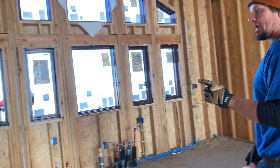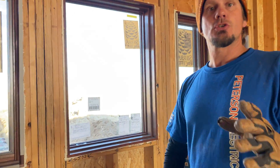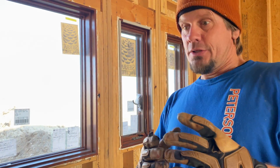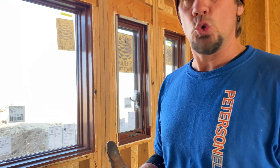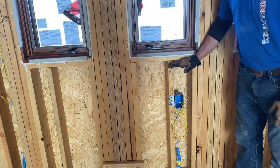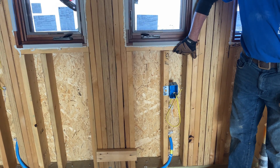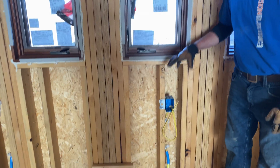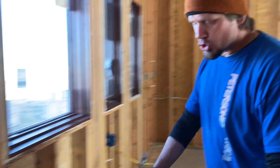Here's another really hard thing I had to deal with — the cabinet guys. Oh man, those guys just want to drive me nuts. They act like their trade is so much more specific than ours. I get it — it's a very custom trade, but they don't have inspectors that look at their stuff. We do. What happened with the architect: he shortened the windows to raise the counter and I couldn't get my plugs in. All I can fit is a backsplash. The code says no matter what, I've got to have my counter outlets. So now we're doing pop-up outlets — they're drilling their quartz counter with a four-inch hole and shortening their drawers.